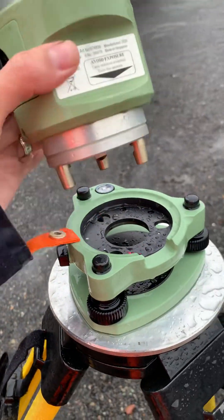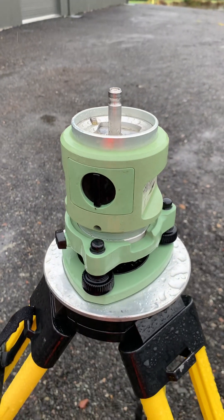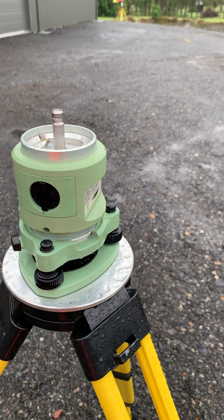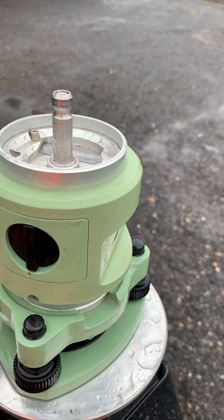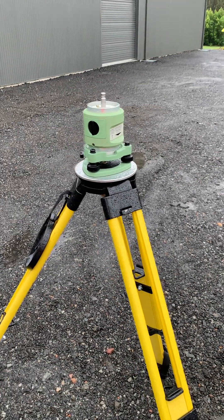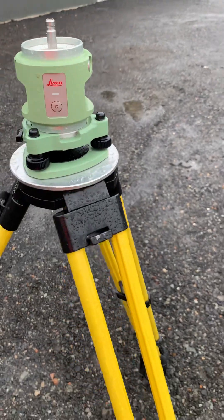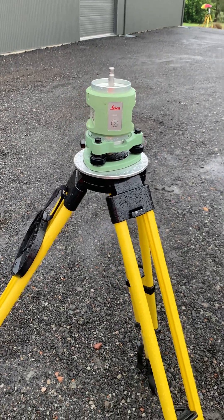I had a subscriber to the channel ask me: does the laser plummet come out of the top? Well, no it doesn't come out of the top. To get it, you have to actually invert the unit. So that's the Leica SNLL321. Make sure that if you take it off, you lock that, because you're going to lift the tripod up and the whole thing will fall off — we don't want that happening. It is a good unit, very accurate, and a lot faster to set up your tripod and tribrac without having to use an optical plummet.